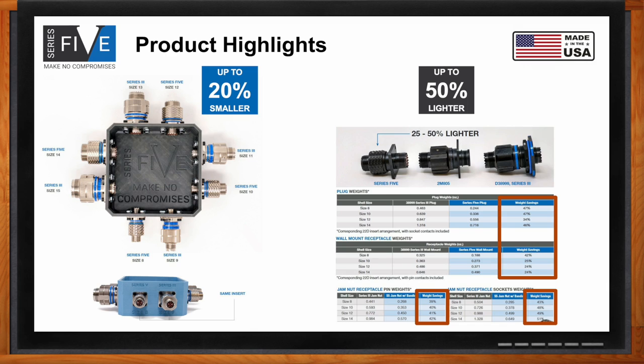We were able to shrink wall thicknesses while still efficiently manufacturing the part - taking so much aluminum out of the design is primarily where the weight savings come from. The actual length of the connector is about 20 percent smaller overall, and there is roughly a 20 percent decrease in diameter, with the largest diameter on the coupling nut also shrinking by about 20 percent for the four sizes shown.